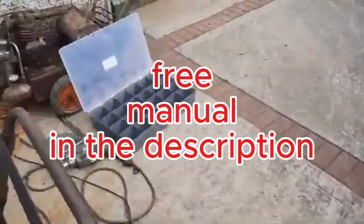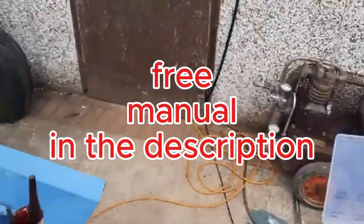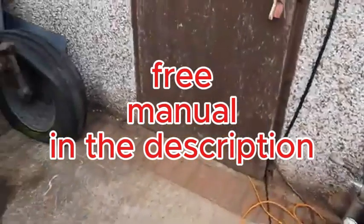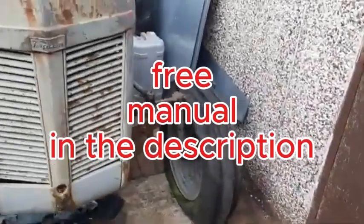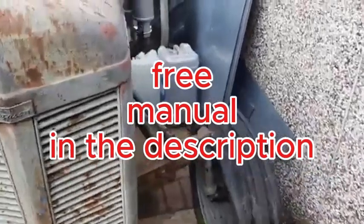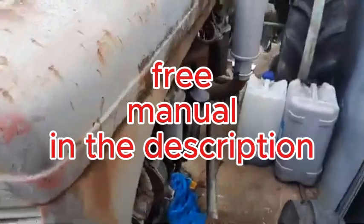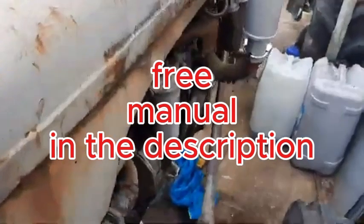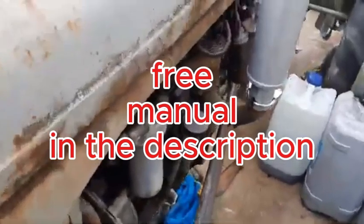Oh, absolutely. Today we have common rail diesel systems that are electronically controlled. Super precise. But back then, mechanics had to manually adjust the timing of this pump using specialized tools. It required a deep understanding of the engine's mechanics, and a very steady hand. Absolutely. The manual actually has a very detailed step-by-step procedure for this, emphasizing the importance of meticulous maintenance.